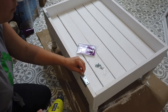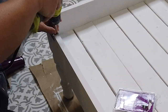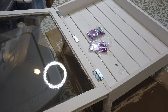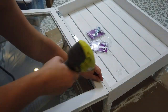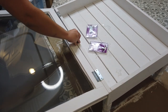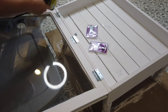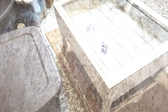After the paint was all dry, I used hinges from the hardware store — they come two in a pack and I used three of them, which are two-and-a-half-inch hinges. I screwed them to the top of one side of the table. Then I propped the window up on a storage box to help me, took the other side of each hinge, and screwed that side into the bottom of the window. And that is all there is to it! I absolutely love how this window turned out — I can't believe the top was once just an old dirty window.